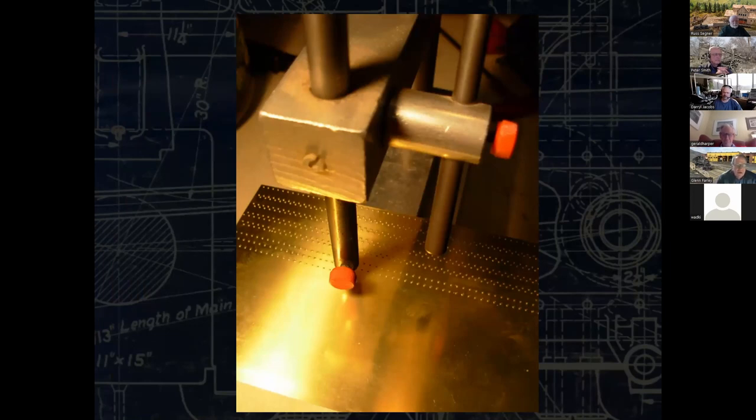And if you can see here, here's straight rivets, obviously. And then we have offset rivets, which is a typical pattern used on just about anything that was riveted together. The sides of the tenders will have those. And sometimes you just need straight rows. You want to rivet when the sheet is separate. You don't want to make a strip and then try to rivet the strip. You want to rivet a sheet and then cut it with the shear, and that will give you the strip you need, because this is an embossing process, it will also tend to distort the metal when it happens. If your strip is just a little bit wider than that, you're going to end up with some pretty funny looking stuff.